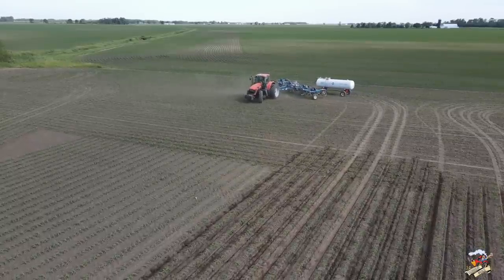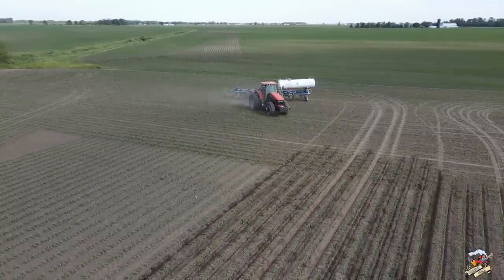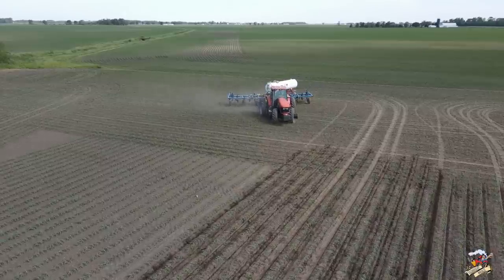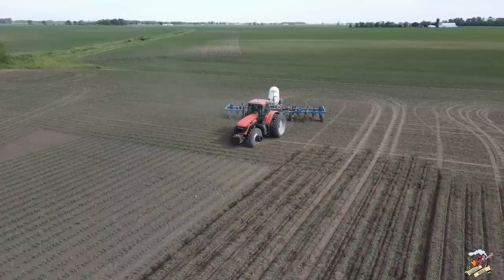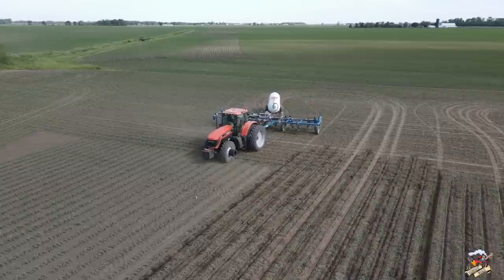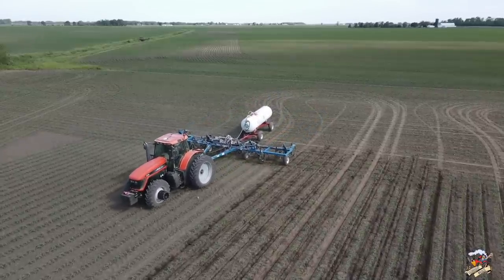A couple quick specs on the Agco DT240 tractor. These were built in France from 2005 to 2008, and this tractor is about the exact same thing as a Massey Ferguson Model 8480. These tractors are powered with a Sisu 8.4 liter six-cylinder diesel engine that would also be 513 cubic inches in size.